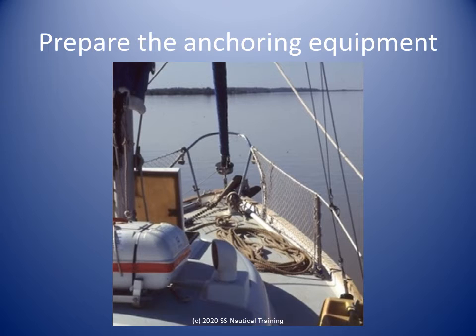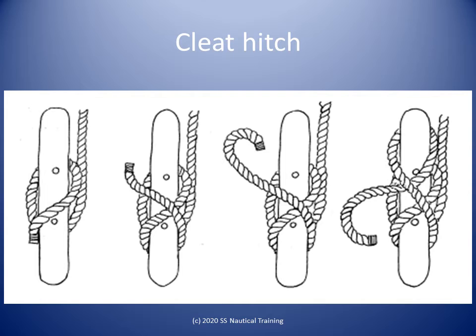On a bollard or cleat, make fast the anchor line at the point you want it to stop. Don't forget to do this, or you'll be diving for your anchor. All of the anchoring equipment should be regularly inspected and adequately maintained to ensure its safe usage. One aspect of maintenance is washing seawater off the anchoring equipment with fresh water at the first opportunity. Seawater has microscopic organisms in it that eventually die and stink.